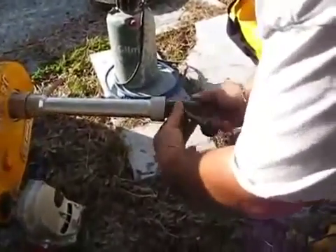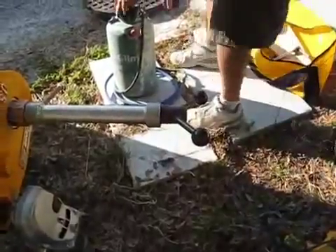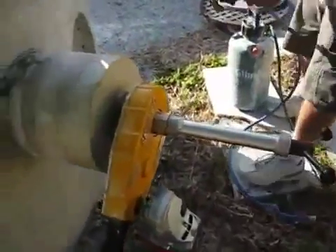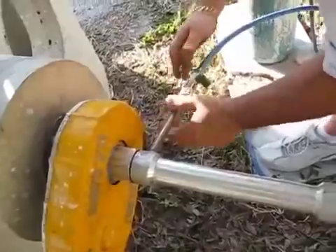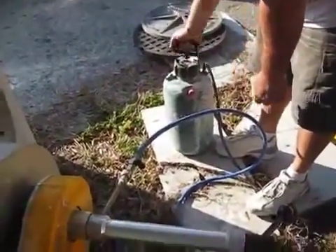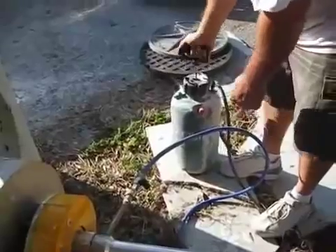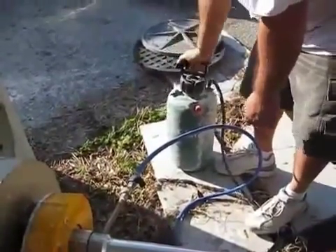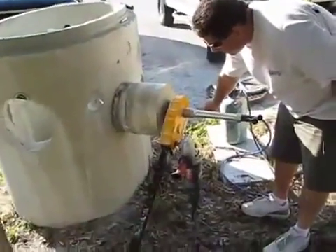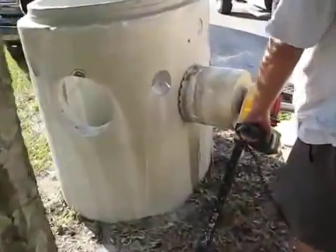The crank, which will provide the pressure that will drive the core bit into the concrete, is the last part of the assembly. A quick-connect water hose is provided; we use here just a small Hudson can. All we really need to do is evacuate the water from the cut. You can hitch a garden hose to it, or even a gravity-fed hose will provide ample water. Your water switch is turned on — make sure water is flowing from the bottom of the core bit.